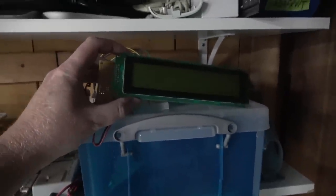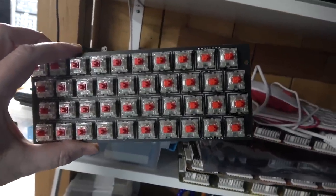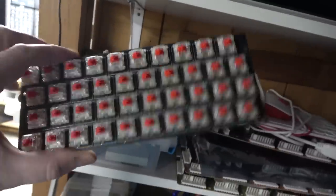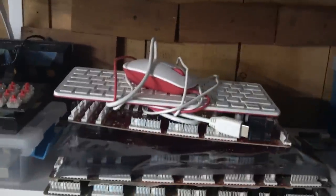I've been trying to build like my own 1980s portable computer — like one of these screens. I got this one and I got this one, which is a full graphics display; it has an inverter circuit on it that needs negative nine volts. Oh, I did buy this — someone had the Harlequin clone of the ZX Spectrum, so I bought the parts to start putting that together. I don't know why — it's not like I need any more projects. Like this Raspberry Pi 400 — why did I buy it?